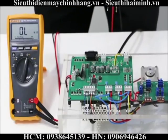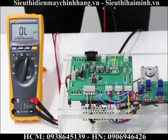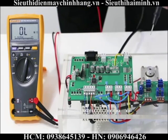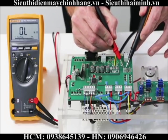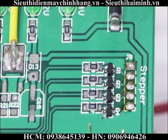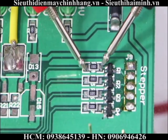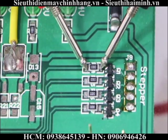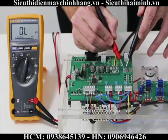The next function I'm going to show you is how to measure resistance, measured in ohms. On my electronic board I have four resistors — let's measure the resistance on each one. The first thing I need to ensure is that my electronic board is de-energized, which it is. I now measure over my first resistor.